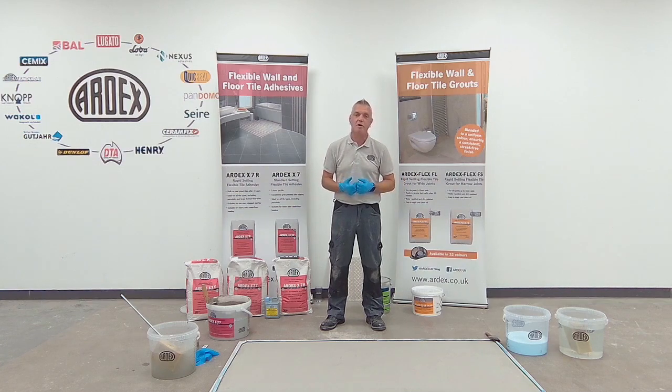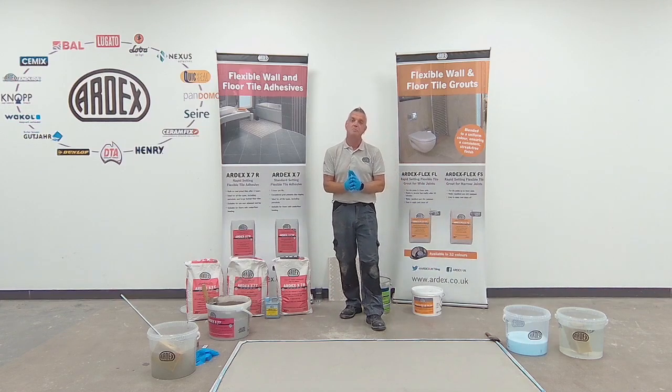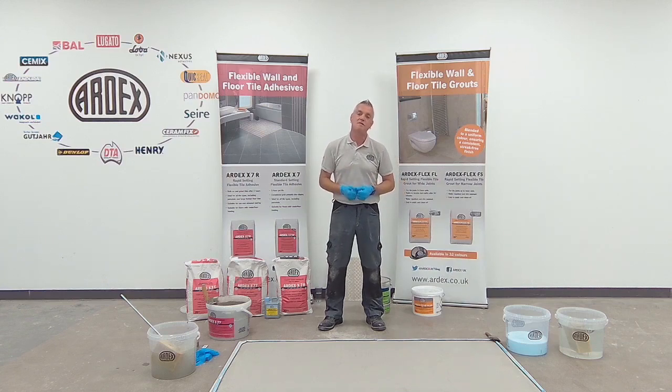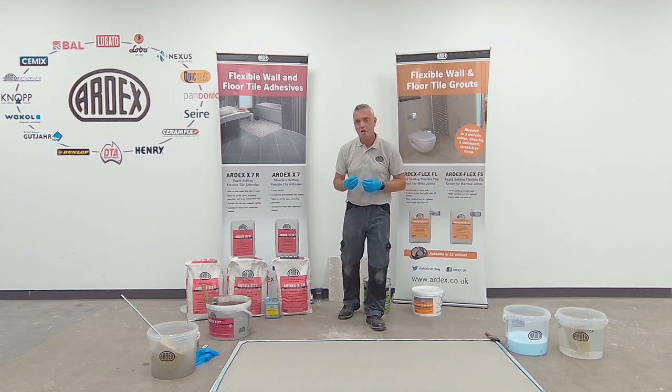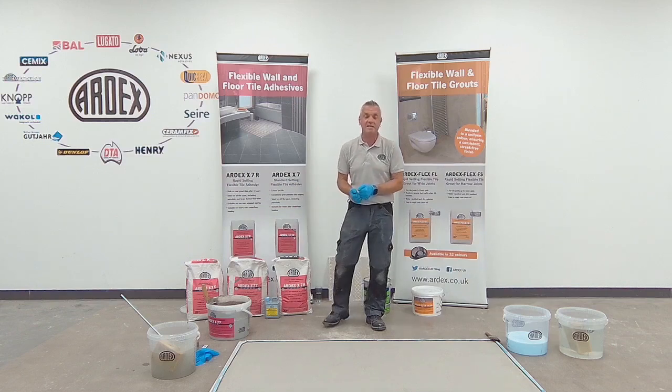It depends upon where you are doing the tiling, direct sunlight. Conservatories are obviously a big one to be mindful of, but also if it's darker substrates, it will obviously retain the heat for a lot longer than something that's lighter. And screeds are generally a lot darker in colour. So when you're looking at substrates itself, and we're not talking about hot temperatures when we're talking outside,